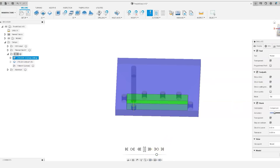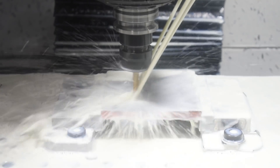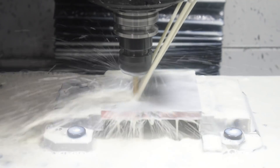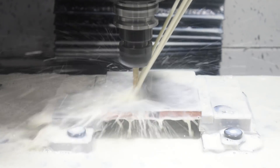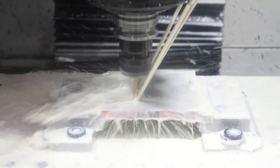The first tool path I used was a deep drilling cycle. I used a coated quarter-inch high-speed drill with coolant and kept the SFM low to keep the heat out of the cut, and the drill did survive. Now if I want to do a production run I would choose a cobalt drill — much better suited in harder materials — or a carbide drill if you have a rigid machine and the power to push it through. I love carbide drills; they're just silent and they leave these perfect holes.